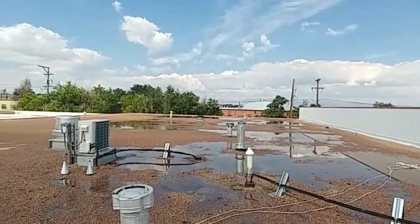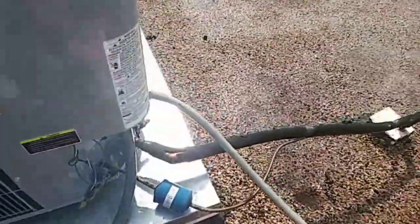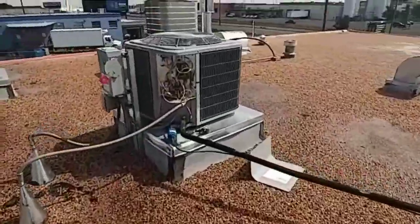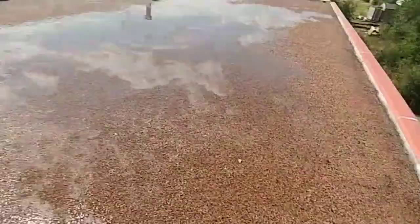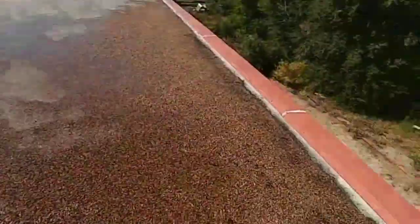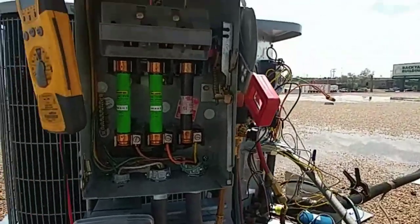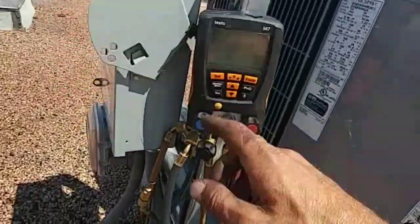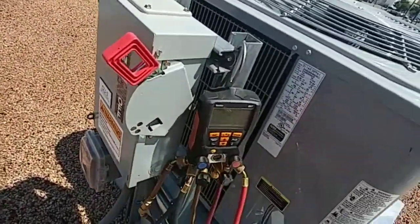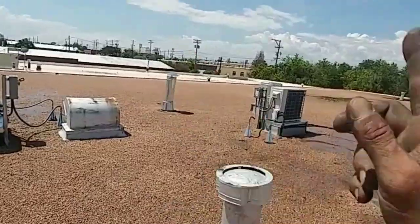Alright, get back in a few — nice day out. So I got 2 out of 3 running really good. I did find a bad fuse, I replaced it, still nothing. I don't have voltage — I only got like 30 volts — so I'm going to go downstairs, check the breaker, and I'll be right back. Didn't have to put any charge in, that's good, pressures were good, just had a bad fuse. Why it popped I don't know — it was a little loose on the pinches so I pinched those in a little more. Now we're going to go install that evaporator coil. I'll put this video up and then I'll put the next one up separate — you guys rock and roll, have a good day, and we'll see you on this coil changeout. Later.